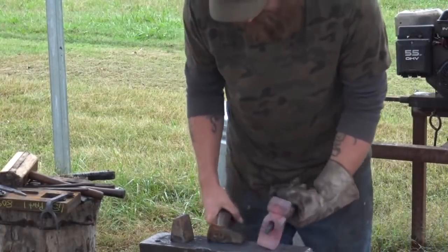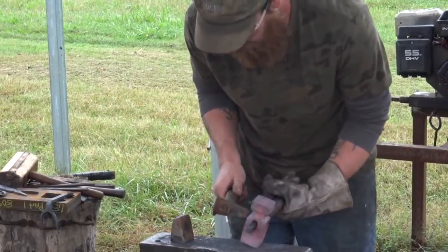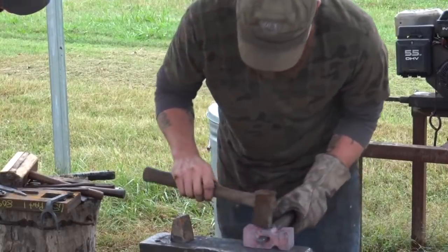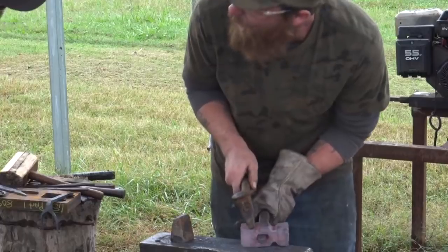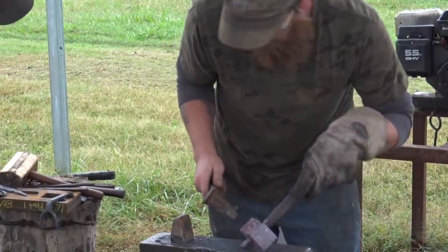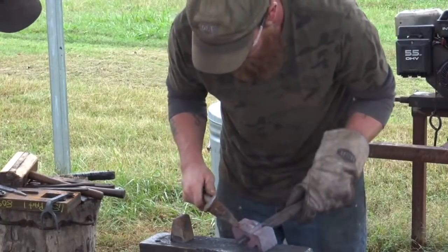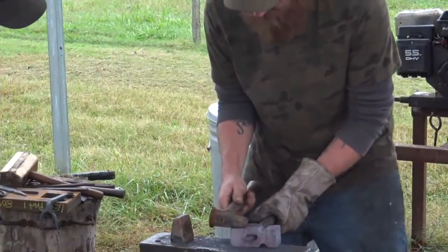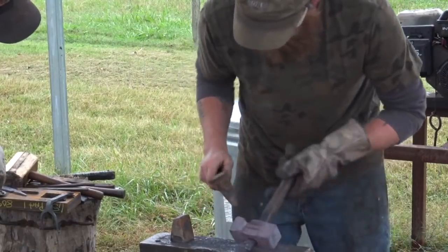All right, we got two of them set in good. We're going to get them good and deep with that, though. We're going to go much deeper with those fullers, but it gives us a good traction point on our fuller tool. And once we get our fullers done, it'll give us a good clean line on the end of the fuller and press out for the beam. That way it'll dress up. I'm going to chase the fullers up to this center point, and then they're just going to kill off back here because that's all going to be dressed up once we come down with the press right there. It's going to give us a nice stop line for our fuller on this side. So, good and even now.